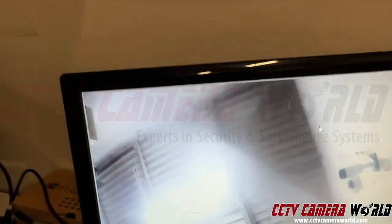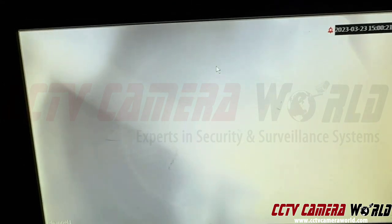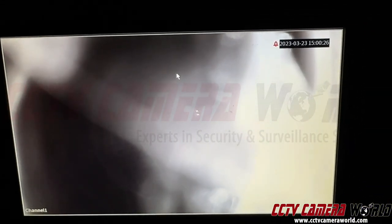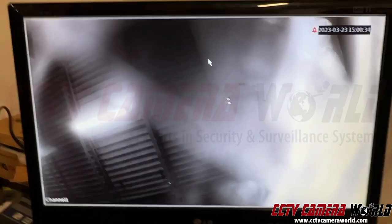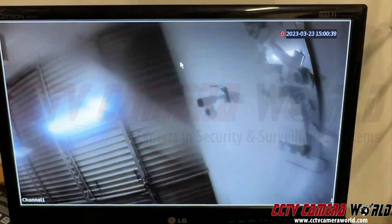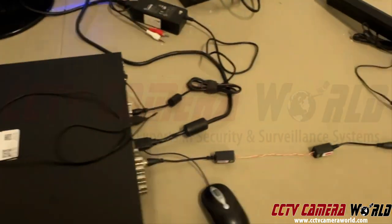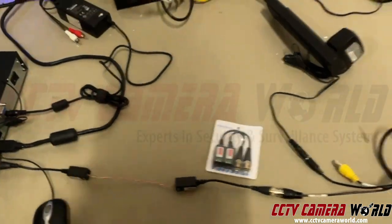Even at nighttime, I'm going to turn the lights off to make sure there are no issues with the signal — and there are none. This is a perfectly clear picture. If there were any distortions, you would see lines going through. If you see lines only at nighttime, then you've got an issue with your power delivery to the camera that needs to be addressed. Hopefully this is a quick yet detailed enough overview to guide you on how to get started with video baluns — and that's how you set them up.